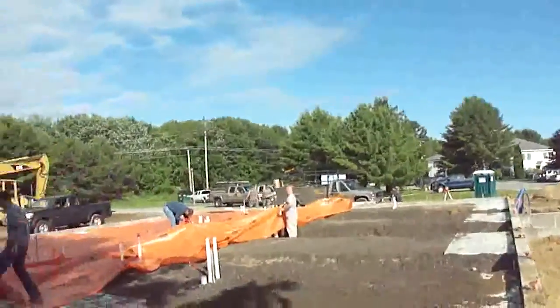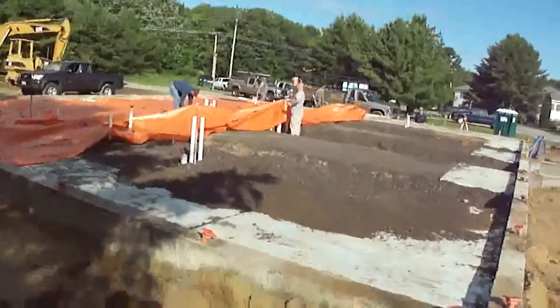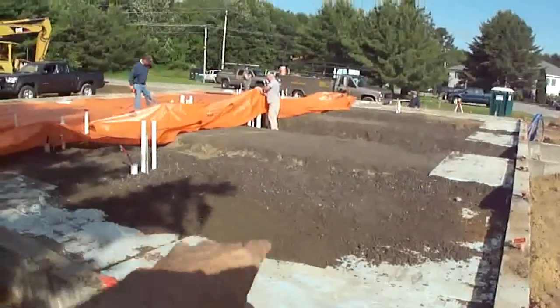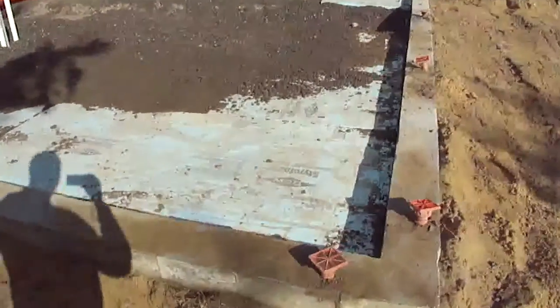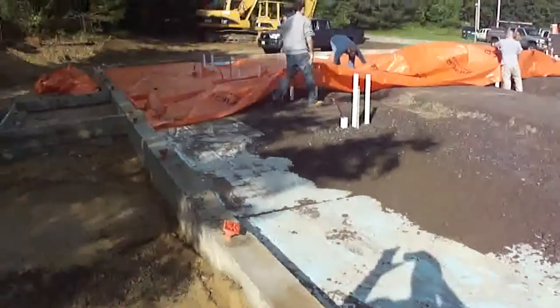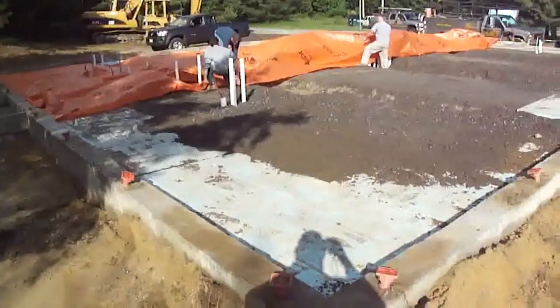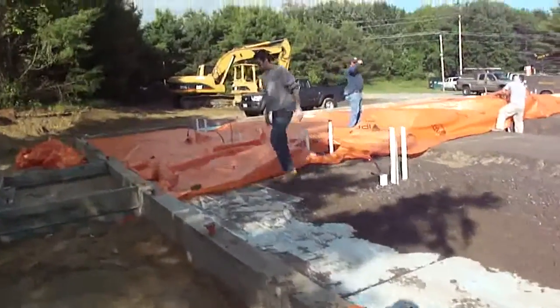The value of that is to prevent any moisture coming up from the soils into the concrete. We have to be able to put our flooring down, and any moisture in the concrete will be a problem. As you can see, we've raised up all of the areas for the soil, we've put our insulation — this is very important to insulate for frost and cold so that it doesn't lift your concrete slab. And now the fellows are putting on a vapor barrier.